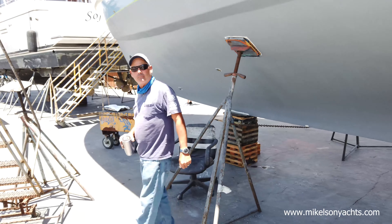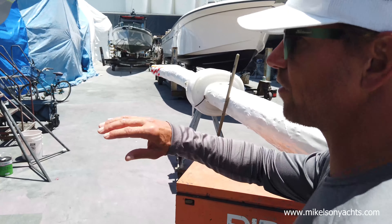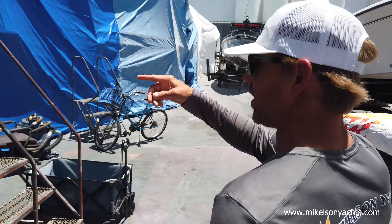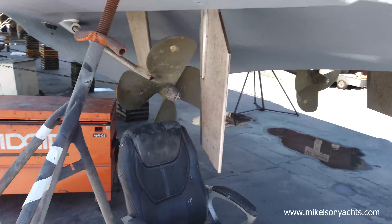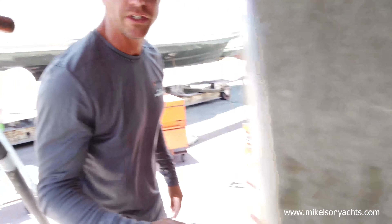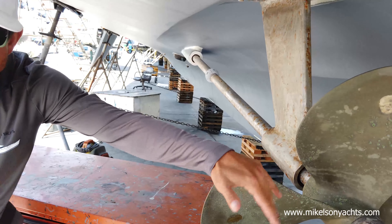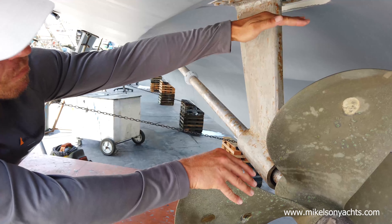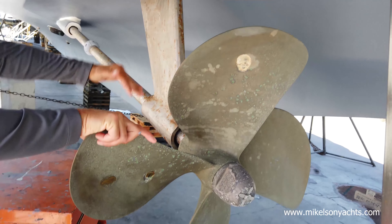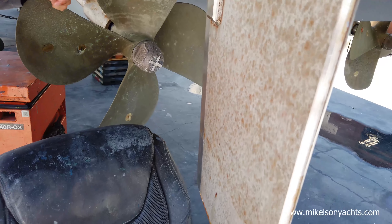Let's step aboard and take a look — it's a bit of a mess in there, we've got a big project going on. Walking back, another really important feature of this hull design is pocketed propellers. It's a little hard to tell from this angle, but you can see we're able to reduce the shaft angle, which is important and makes the boat more efficient. The less of an angle the shaft comes out of the boat, getting it closer up to the hull, the more efficient it is. Putting the propellers in a pocket like this allows us to reduce that shaft angle and get the props away from the keel, giving the boat protection from grounding. We have nice big solid plate steel rudders on this boat — these are huge rudders.